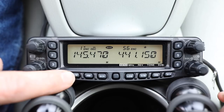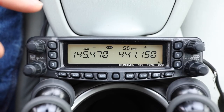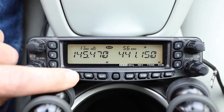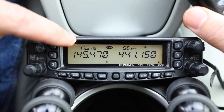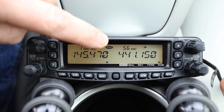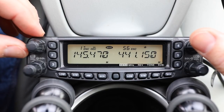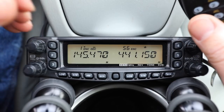This is where you toggle your VFO, so now you're in VFO mode in which you can punch in whatever numbers you want, then back to memory. Currently if I key up and start talking I'll be on this side of the radio — it's set to main and that's lit up — and you can toggle from left to right by simply depressing the tuning knob. Now I'm on this side of the radio.